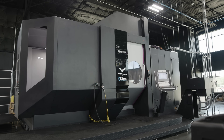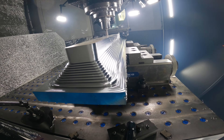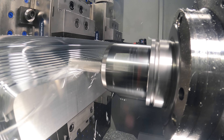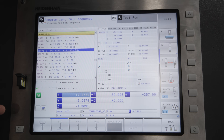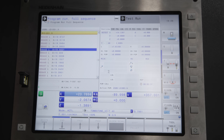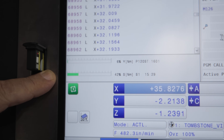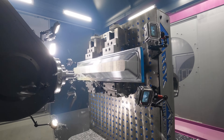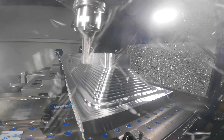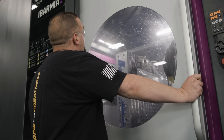And finally, number one: knowing your machine. I know this cut is going to require 67 horsepower and 44 foot-pounds of torque. Looking at our torque chart, I can see I have 100 horsepower available at 8,000 RPM and 59 foot-pounds of torque available. On our spindle load readout, we're barely scratching the surface — not even at 50% of our max load.